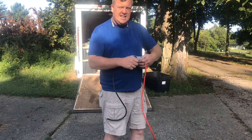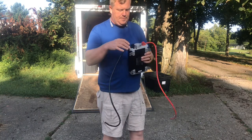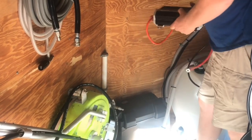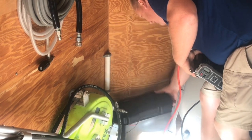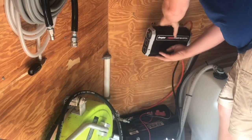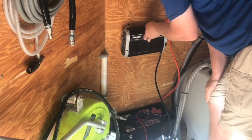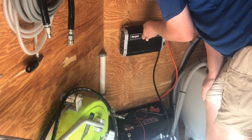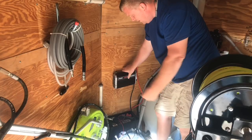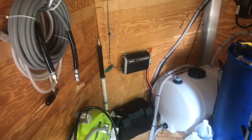Now I need to figure out where to mount it. I'm going to mount it in my trailer and run the wires to it. Here's my battery — I'll take the cover off. I'm going to mount it semi-close and orient it this way to keep water out of it, as high as possible. That way if water sprays in over here it runs off rather than running into it. So I'll mount it with the ports facing this way so water can't get in.